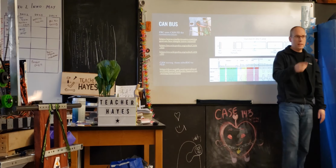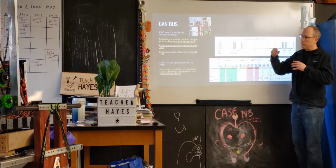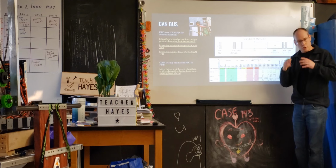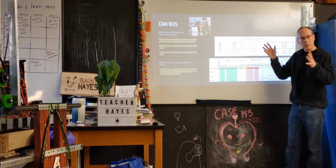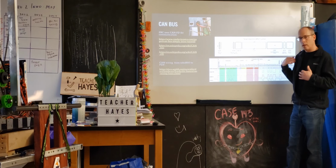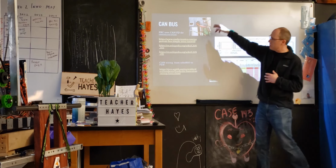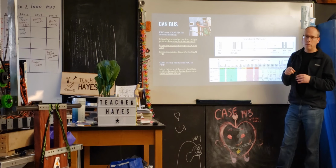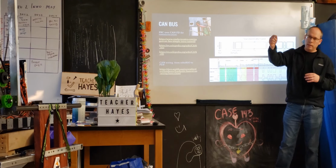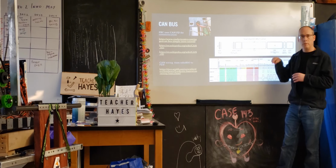When we daisy chain, as Jack was discussing, any of these devices might be sending stuff, and all the other devices can hear it. So you can only have so many devices that are doing that because you're sharing that medium. Because as soon as I toggle here, everybody else might be seeing that. And in our case, usually the data from the CAN is being listened to or sent from primarily the RoboRio. That's where our software is running. And so it's how it's sending signals to each of the different motors to tell them what to do. It's all across this.